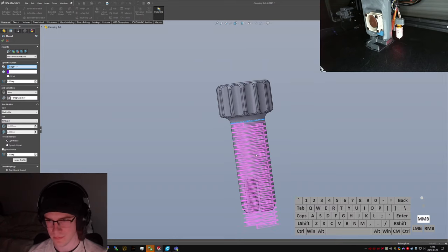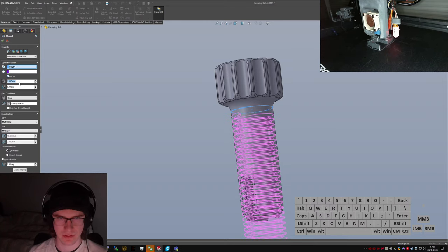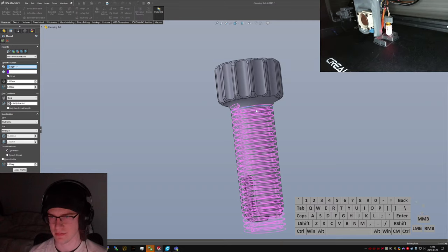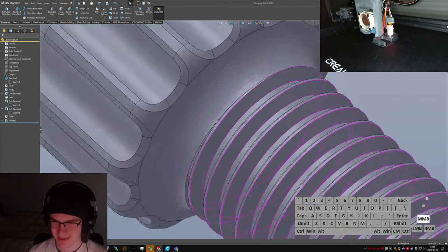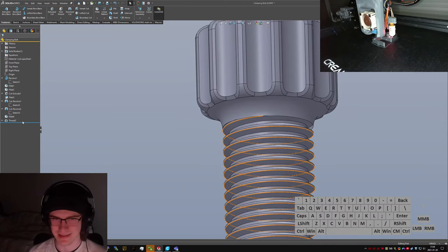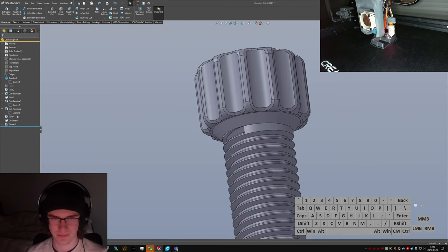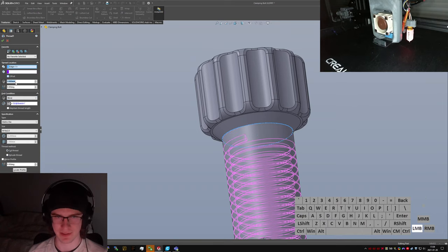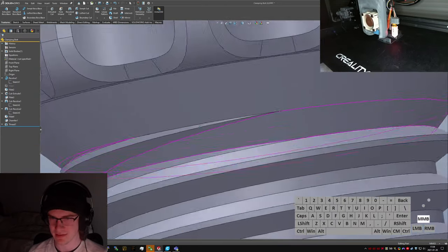Sketch one. Trim with start and end face. I am gonna need a negative or offset of 2 millimeters, maybe? That should be enough. Nope, that's not even close to right. What? Oh, gross. Okay. I think maybe I can control Z my way back to that chamfered one, though. Yeah, okay. So now we've got our chamfer back. And now we can do the offset and offset it into the part, and it should, yeah, terminates that very nicely.